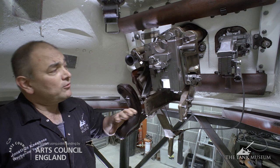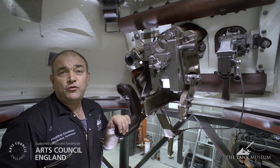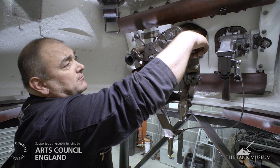I've put the mount in the barrel and the breech block, and now you can see it all in its entirety together with a machine gun. The way the machine gun will work: firstly cock it, pulling the whole trigger mechanism to the rear, and then using one of the two firing switches — this time the one on the right — you pull in on the trigger and the working parts are released.